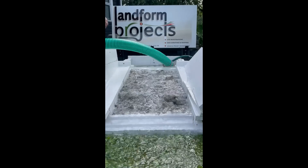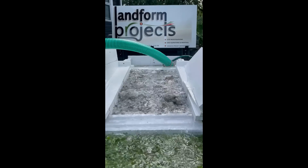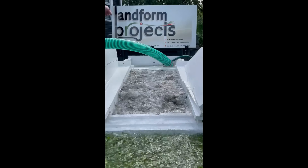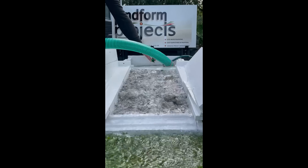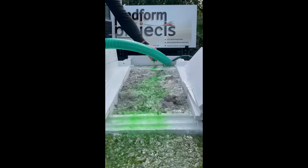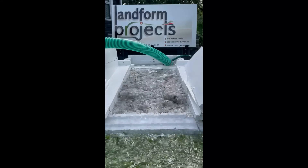The pond level is up to 6.8, so it's risen by a few hundred millimeters, and the flow is starting to use the full width of the weir — now about 200 mm over the weir. I'll add a drop of color dye and crank it up further. You can see it goes pretty quick. This is now cranked up to about 80 percent on the tank.